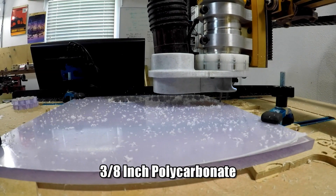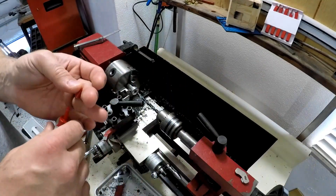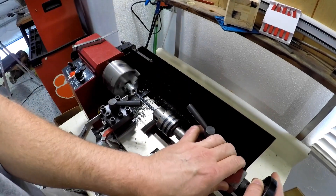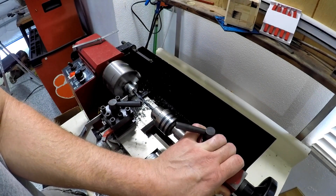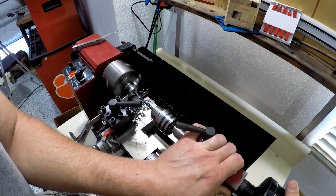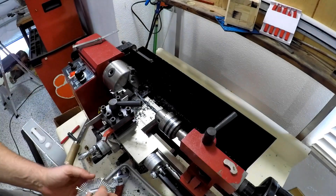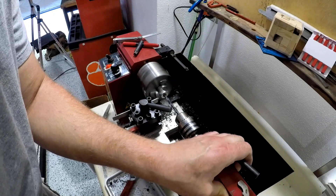Some of the driving gears are out of thicker material which helped keep everything from slipping off. Another thing I haven't mentioned yet is how I get the power from the motors to the driving shafts themselves. I used a misalignment coupling which was supposed to be quarter-inch to six-millimeter but it was a little bit off - considering I paid a dollar or two from China for it, I'm okay with doing some drilling. Then I put it on a heat sink to cool it off faster.